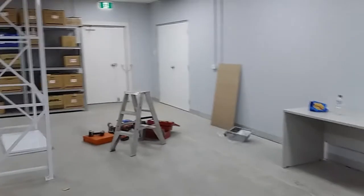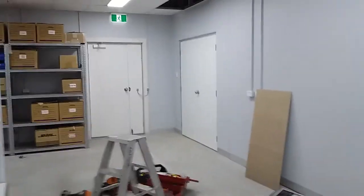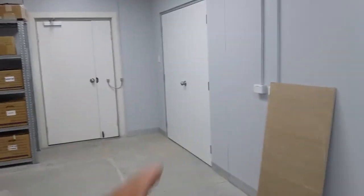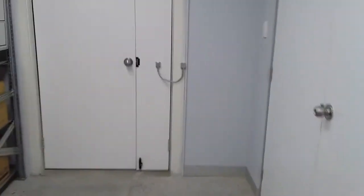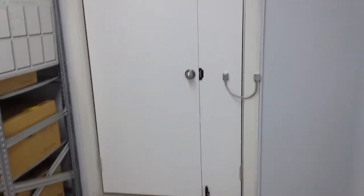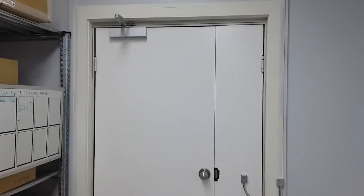And another door over here. We've got electrical there, and I've done a cable transfer. Knob set is always free from the inside. Door closer again. I also ended up putting another patio bolt on there. The frame is a little bit out of whack — that'll need a redo and the light switch has been removed which is going to be bogged and painted again.